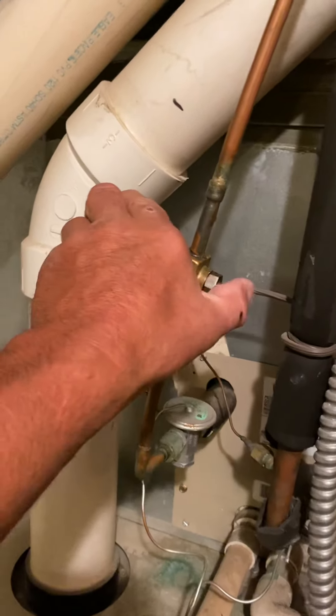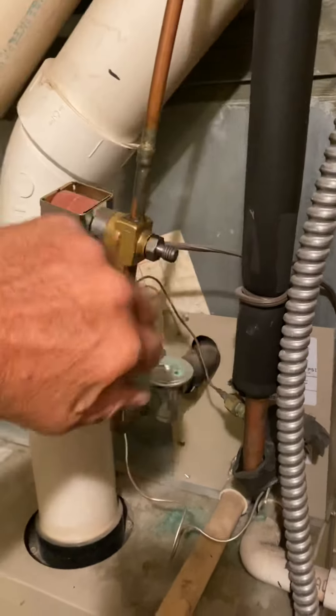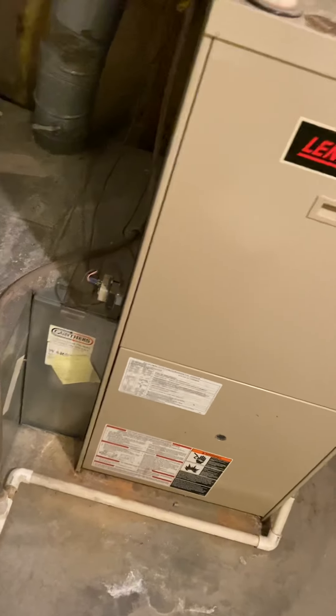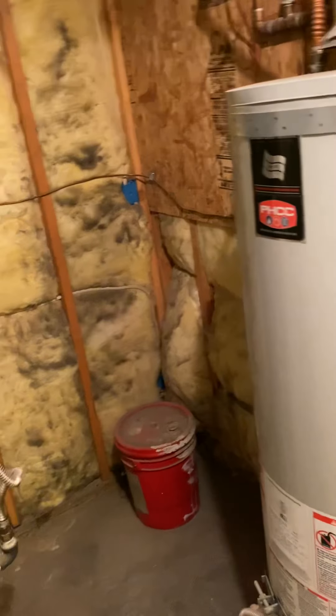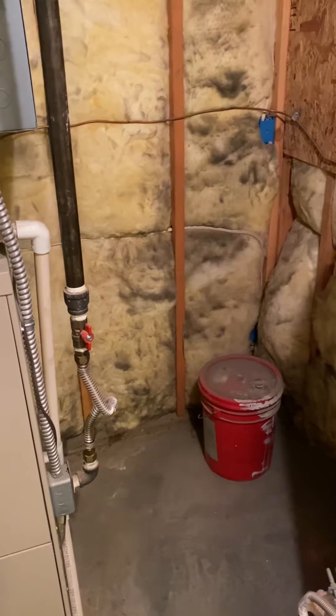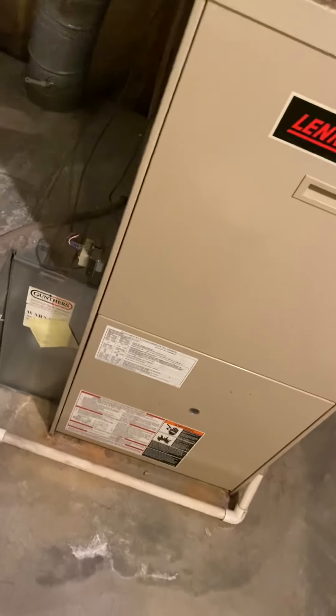While I'm down here, we will replace these solenoids — they need special R410A solenoids. So yeah, replace these and the coils. In the condensing unit, you will use the existing relays and controls so don't unwire them. Or if you do, take a picture of them first so you make sure you get them all wired back up the same way — the two relays for Y1 and Y2.